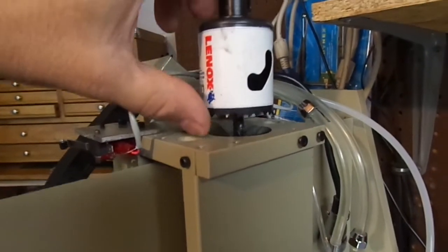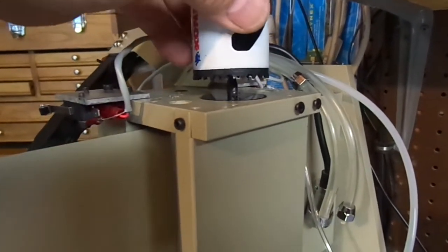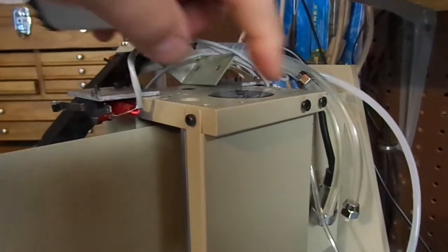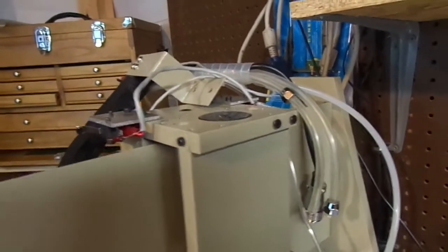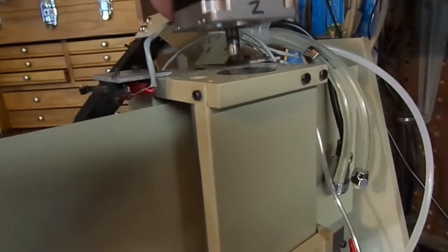The hole saw will come down and cut the hole out. When we're done, the slug will come out, the hole will be larger, we'll put our shim down for the motor, and the motor will be spaced off.